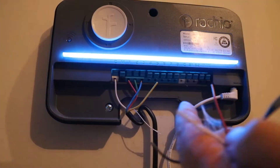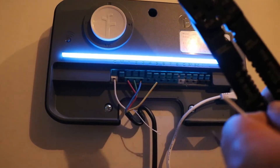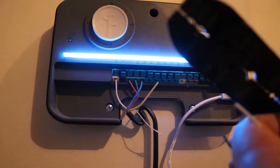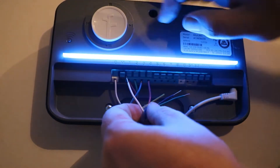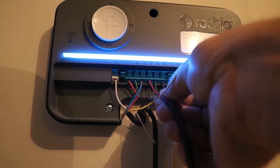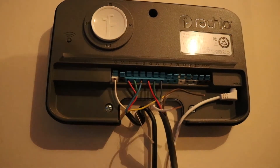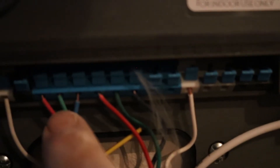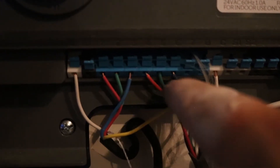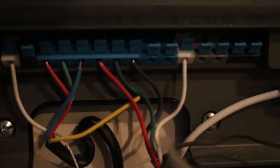18 gauge pulls it right out. So we got red, green, and blue — go ahead and put station four in there. For this, let's go ahead and turn the power off. Over here in the common, these three are already being used, and these three are the ones we're putting in. Here's the extra common wire. On the other end in the valve box, we'll combine them into a single wire to use that same common wire.